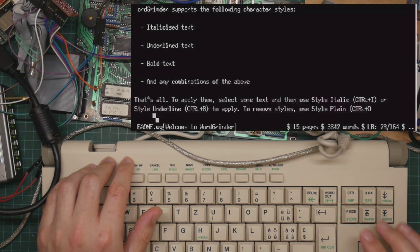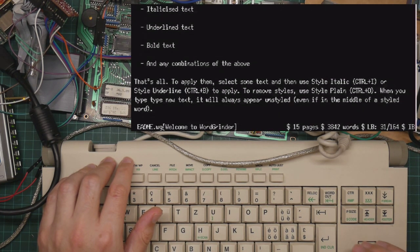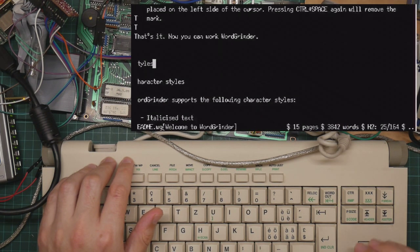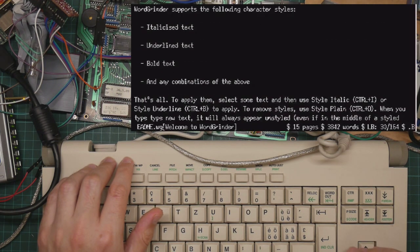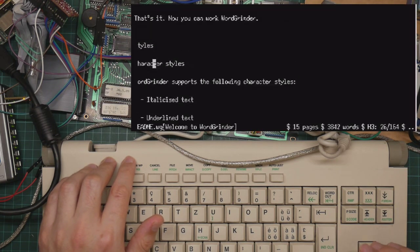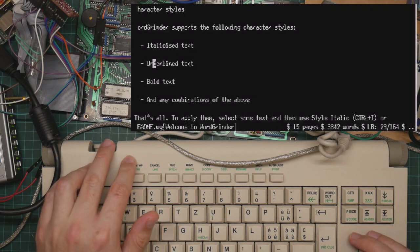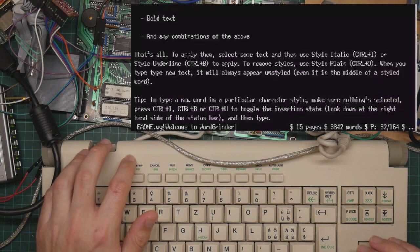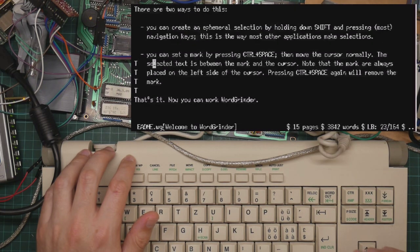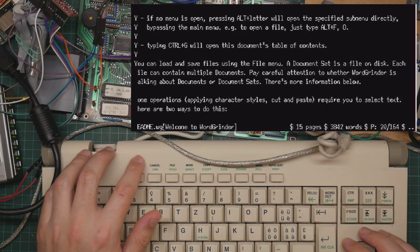However, this of course will double the amount of video memory that we need to update each frame. And there's already a little snow at the top of the screen when scrolling, so really it's currently set to 7 lines of update per frame. We would need to switch that to 6. And of course, doubling the amount of memory that gets updated switches it to 3, which is not a lot. So I'm wondering what I can do about that. I do have a few plans.